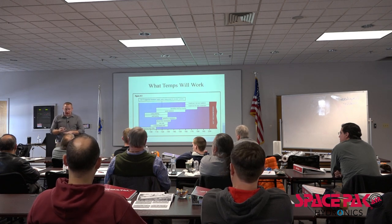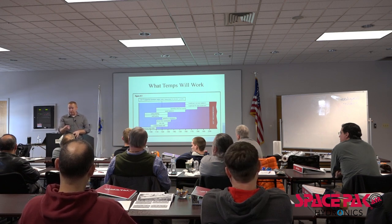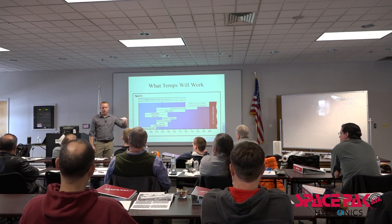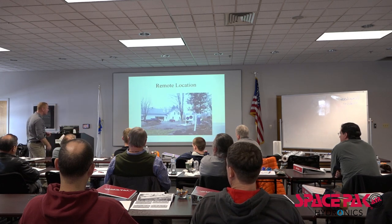Sometimes folks have put them in line with a plate heat exchanger, because if we go outside with water, remember, we're going to want to add antifreeze to the system, right? We put in a plate heat exchanger, and maybe we use that 120 or 130 degrees to start to heat that electric water heater, or start to heat another heater, whatever we're using, whether it's an indirect or something.